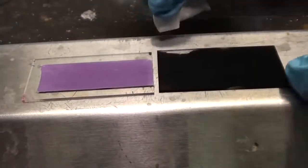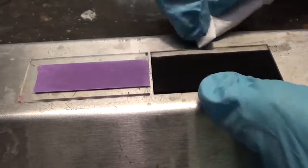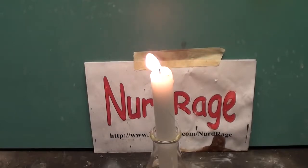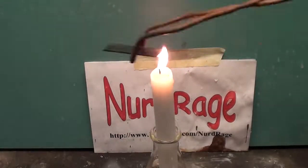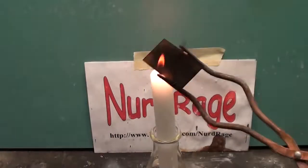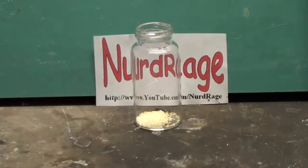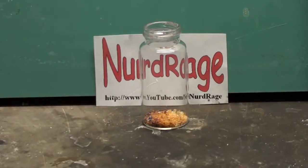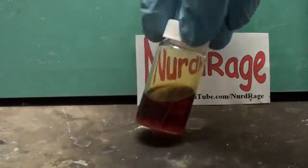The back electrode also doesn't have to be glass at all. A conductive but non-corroding metal or plastic could be used here. Now, we used carbon soot as the redox catalyst, but this isn't very good. Laboratory solar cells use platinum metal, but obviously that's too expensive, so a replacement is needed here. The potassium triiodide redox shuttle could also use some improvement. Maybe an organometallic complex might do the trick. Finally, the ethylene glycol solvent could be replaced. Perhaps an ionic liquid could do better.